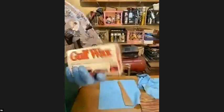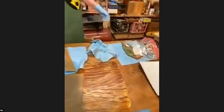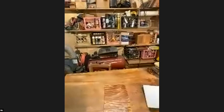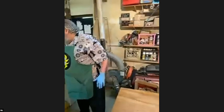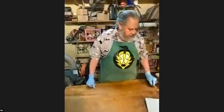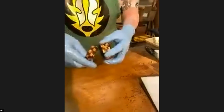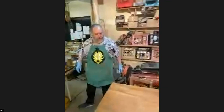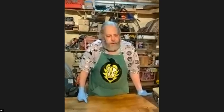Paraffin — also called canning wax — you'll find it in the grocery store in the canning aisle. Melt it, brush it on, scrape off the excess. The simplest finish out there is oil, though it's not an extremely effective one. I also turn bracelets and napkin rings and drop them in oil for a couple of days and wipe off. The problem is that building a finish with just oil takes many coats and is a fairly soft finish.